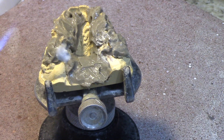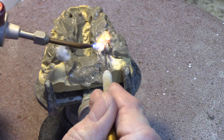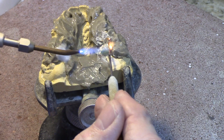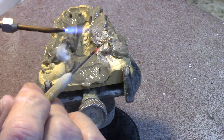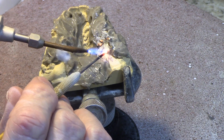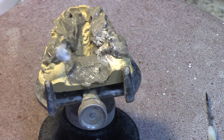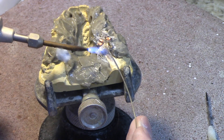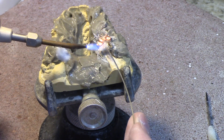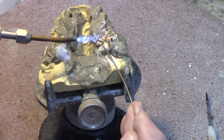There's enough solder to sweat the joint. Now I'm going to take my titanium probe and heat the solder up again just to the point where it melts. Then I'm going to back the heat away and use the probe kind of like a paintbrush — painting that solder all around to make sure I've got a good surface of the nickel silver solder adhering to the stainless steel crown. Now I just go in and add the bulk and completely encase all the wires.